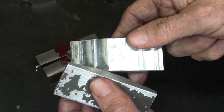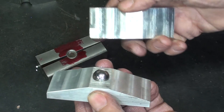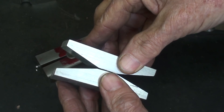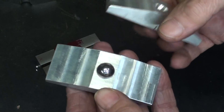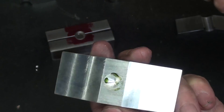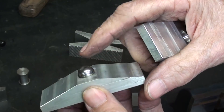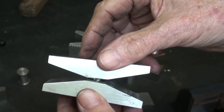There they are, and they look pretty good. There's the ball. It swivels in all directions. I've already marked it with black lines and I'm going to take it over to the milling machine. Using the sixteen-degree angle block that I showed you in the other video, I will produce the angles. The Loctite has set. You do not want the ball to fall out, because when a hardened ball hits the floor, it never stops bouncing and you will never find it. So you do need to secure it.